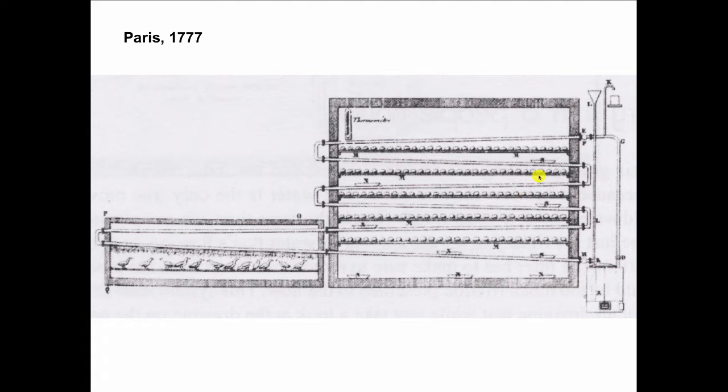Oh, and think about this piping arrangement too. It doesn't really lend itself to zoning, does it? I mean, if you put a valve in anywhere, the heat stops everywhere, and you look at that and you say, who in their right mind would do that when they could do bypasses and zoning and all that? Who in their right mind?